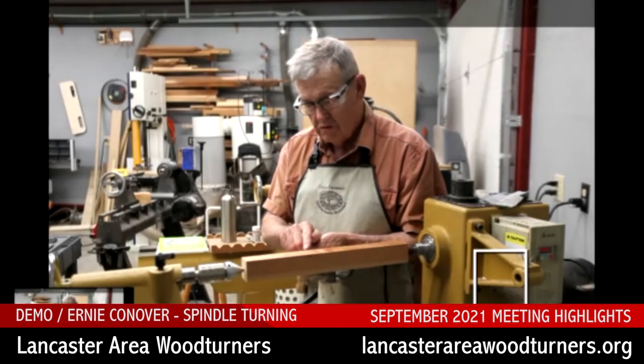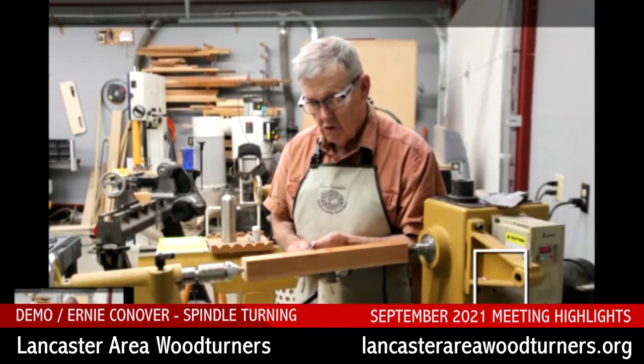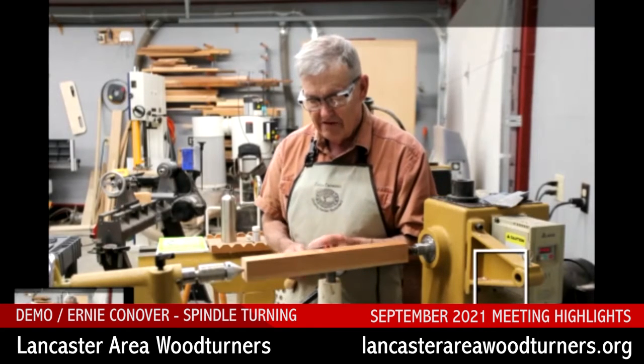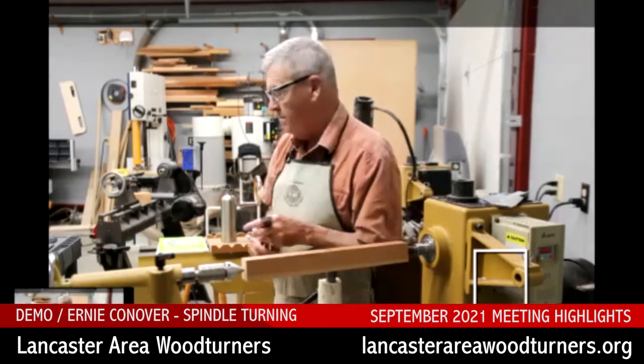And if you have a hollow grind, there's no bevel contact between the edge and the heel of the bevel. So it's sort of trying to auger in all the time. By going to a flat bevel, it's much better supported, and it's easier to feel that bevel.